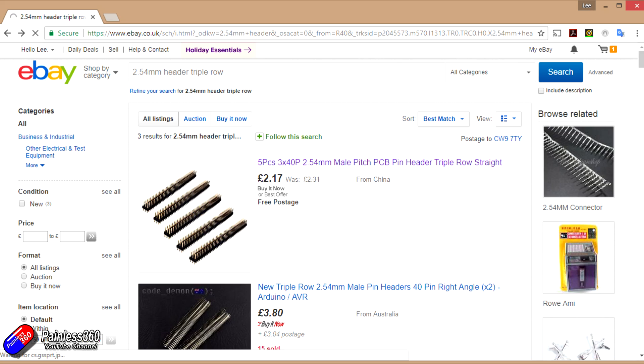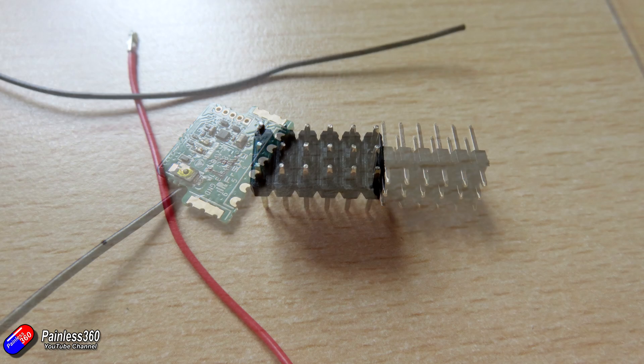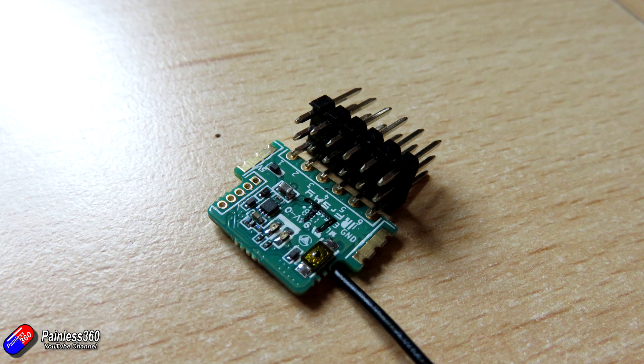You want a little row of 6, and these 6x3 header pins will become the connections for the servos. The only other thing you need is a couple of bits of thin wire, a good soldering iron, and a steady hand. We're going to solder the bottom connections onto the pads of the receiver itself — that handles the signal. Then we connect the middle row of pins to the plus 5 volts, and the very top row to ground.